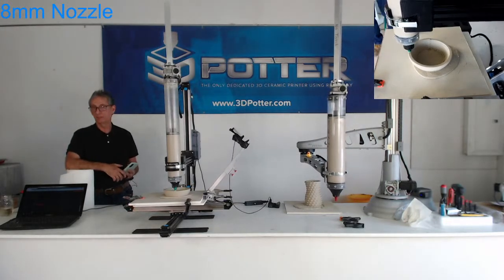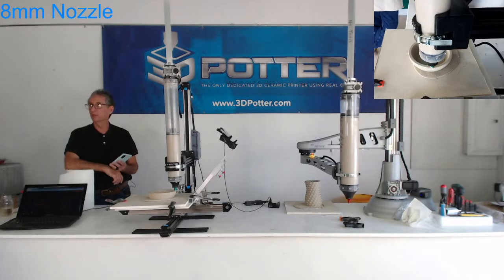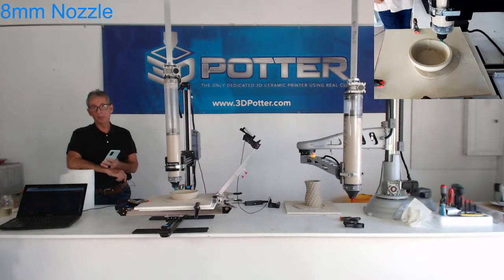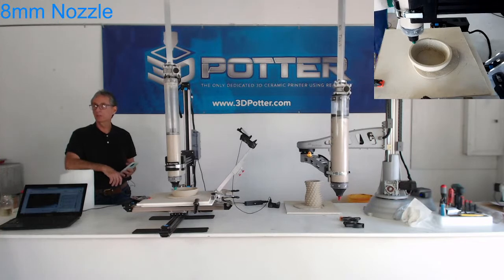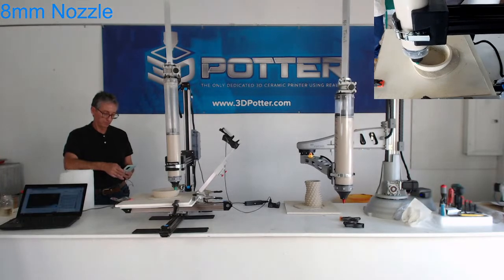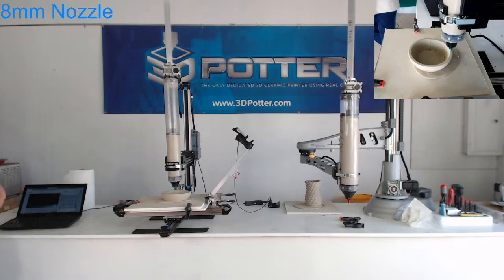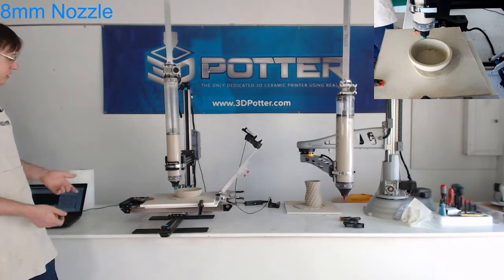We can go down to half a millimeter, but it's not practical. Yeah. We make 1mm nozzles. We have a customer that wants a 1.5, but typically it's not practical for most of the clays we use because it takes too much pressure to push it out of such a small orifice. So in reality, 2mm is about minimum, don't you think? Yeah. If I was in a school environment, I'd definitely not want to go smaller than 3. And even if you had a huge group activity or a lot of students, a 3mm nozzle will preserve the amount of clay because smaller nozzle means less clay.